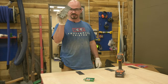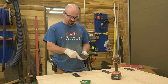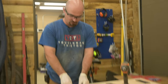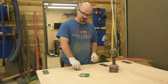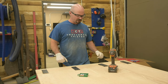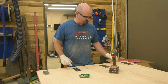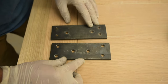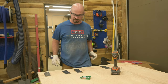We've got it flipped over. These are the steel straps we made — it's just 3/16-inch steel cut into six-inch pieces with three holes in each. When we first started screwing them we had the holes clustered together, but then I realized the weak point is where the screws go into the wood. Having them spread far apart increases the lever arm, so more force on the edge grows the force at that point. We got smart and brought the middle holes closer to the lip to shorten the leverage whenever someone's pushing on the edge of the table.